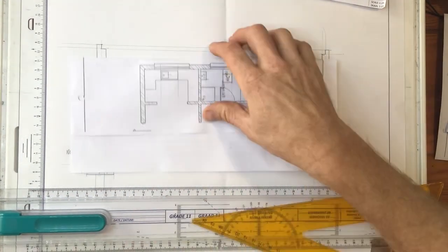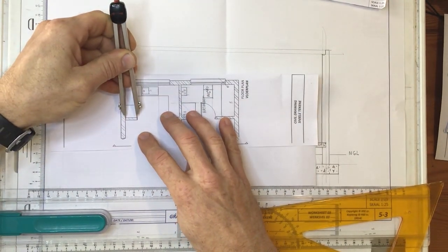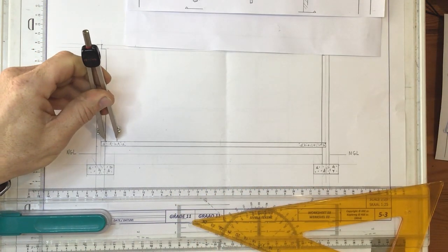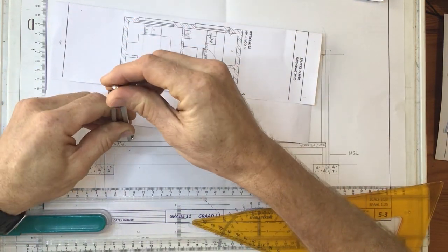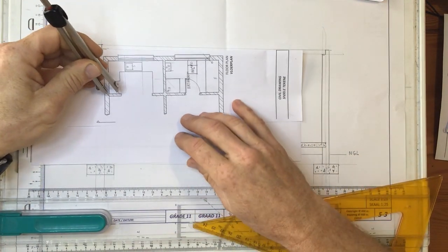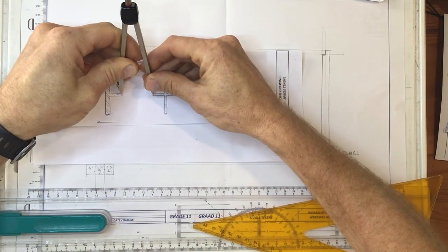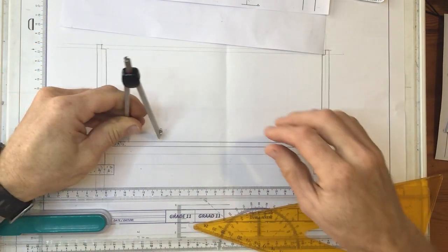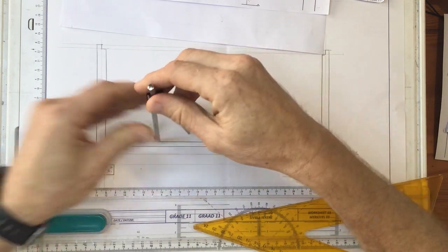I just need to double them. I've got the inside of the wall and this little piece of wall sticking over there. I come over here, come to the inside of my wall, place that measurement that I just got off there, place it down and double it. Put a little mark there. Then I go back over here and measure off the length between the door and that. There's the door distance. I need to double that when I come over here, take that, place it down there, double it, and lock that in.